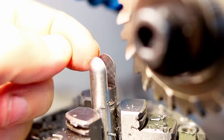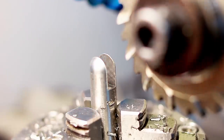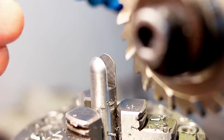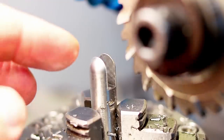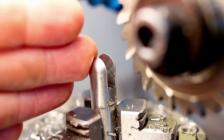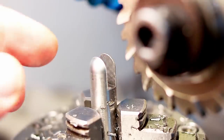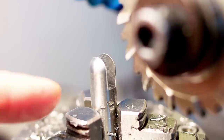Note the crosshatch pattern on the sidewalls of the slot. This means two things. First of all, the tram of the horizontal spindle of this machine, which is basically in the machine geometry, is good. If the spindle was off like this from the y-axis, it wouldn't leave this mark. It would act like an untrammed Bridgeport spindle, for example.